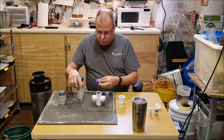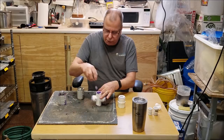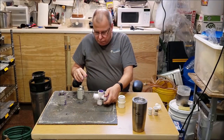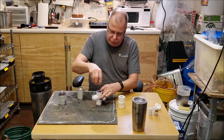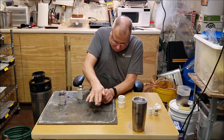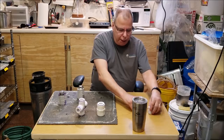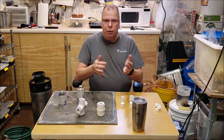I'm going with three quarter inch thread on one side and three quarter inch female on the other - that's pretty hard to screw up since they're the only two left. I was able to turn that a little so that's good. I'm probably putting a boatload of glue on that I don't need, but that's alright. The T assembly is done - next I have to cut and prep the pipes: a half inch one and a three quarter inch one.